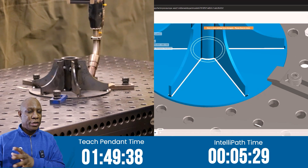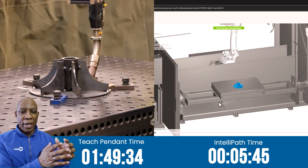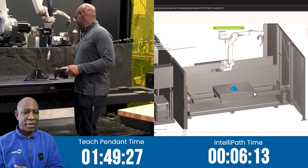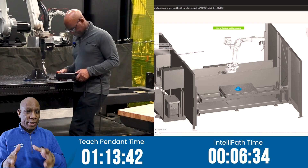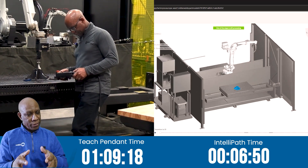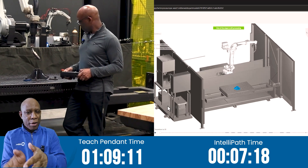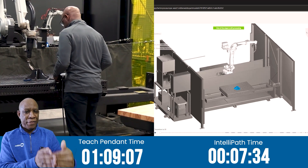By using the two-point touch sensor and just finding the center of the plane, I can reduce that amount of time from about 50 minutes of touch sensing to about 10 minutes — time saved: 40 minutes. The touch sensing strategy worked. Now, to think about programming the welds. I know that the propellers are evenly spaced, so I'm going to use a 3D shift to program the first propeller and then simply shift to the remaining 5.